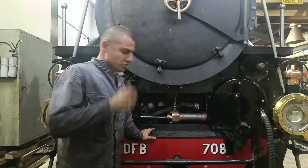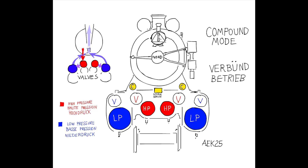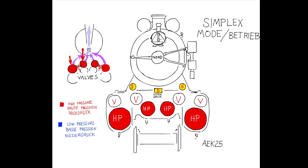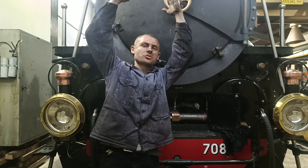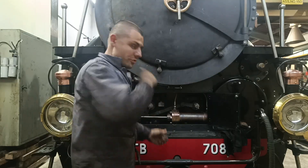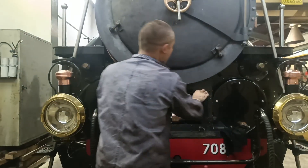The simpling valve on this engine is not like most compound engines. If we had a regular four-cylinder compound like in France — a mainline engine — the simpling valve would turn the high and low-pressure cylinders all into high-pressure cylinders, receiving steam from the regulator and exhausting up the chimney. Same for certain three-cylinder machines, but on this one we cut out the low-pressure cylinders entirely.